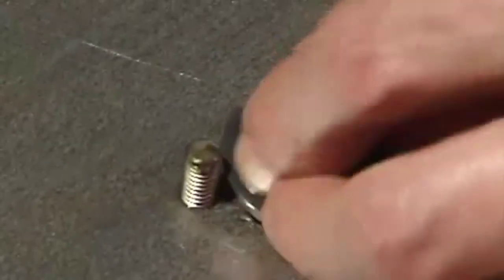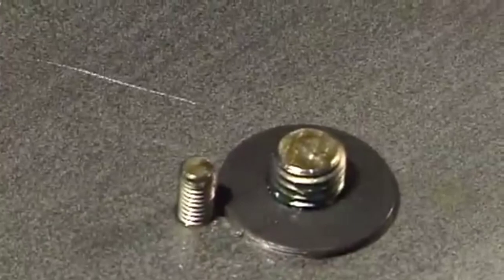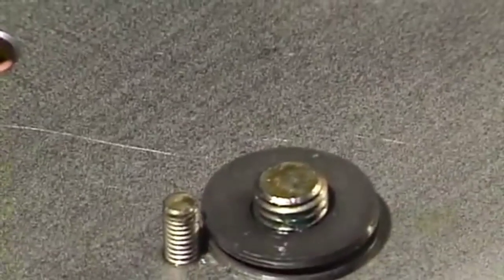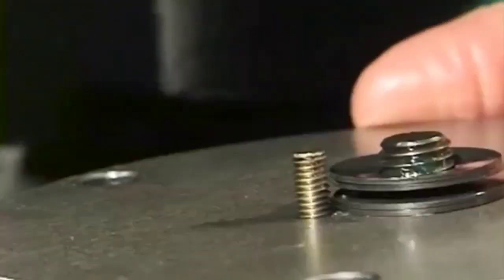Only necessary when replacing the cup springs: place the cup springs on the hex head screw. Pay attention to correct positioning. Bolt tight the bearing cover with sealed-in hex head screws and disc with hex head screws.